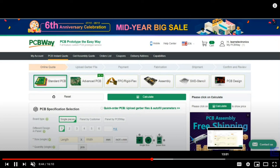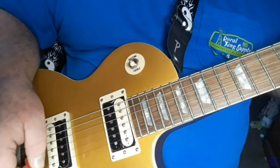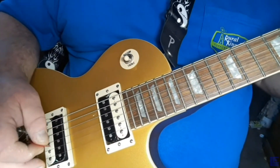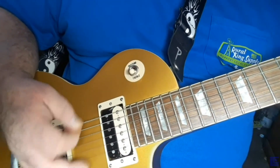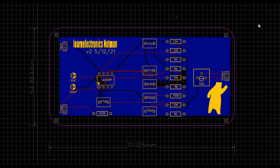Let's listen to how the old one sounded. All right, so you heard what the original sounded like — it's basically just an overdrive sound. I found it very thick, very bottom-heavy. So what I've done is I've changed a couple of these capacitor values to change the frequencies that we're dealing with, and I'm hoping that's going to make it a change for the better.